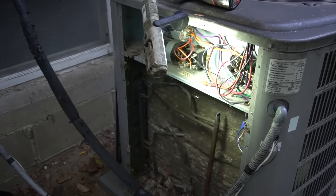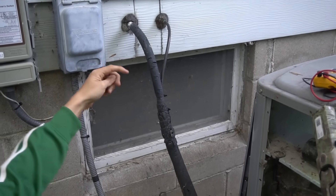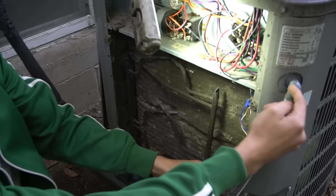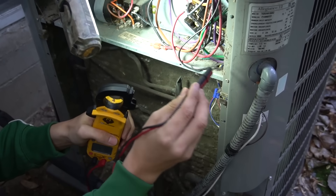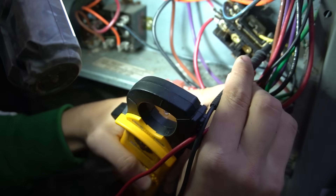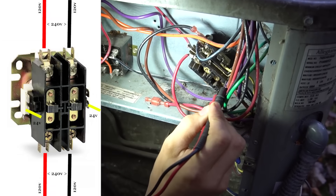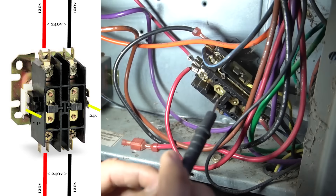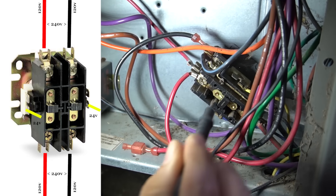There's also a thermostat wire — a lot of times it'll come from the disconnect, sometimes with the refrigerant pipes, or out of the wall — but it's also routed straight to your AC condenser unit. So right here we have two hot legs coming in. The two hot legs come in straight from the disconnect into one side of the contactor. If I put my two leads on the two screws here, I've got 245 volts. Power goes through the contactor and comes out the other side to power up the compressor and the fan. What interrupts this is this little plunger right here. The contactor coil contacts are on either end where the blue wire and yellow wire connect.